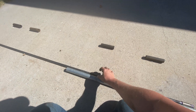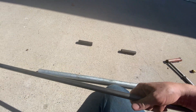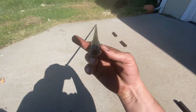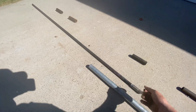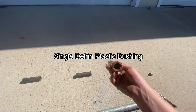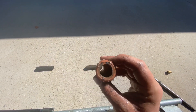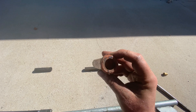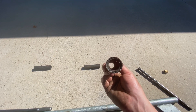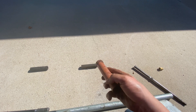After pulling a lot of grease and grime off, the shaft is in pretty dang good shape - pretty tough. I even beat on it with a hammer to get everything out and it's fine. Now the bushings - here's the plastic bushing. This end piece, closest to your prop, see how it's small. Now look at this - the other side is a little bit bigger. The shaft is vibrating inside and eating away this bushing.